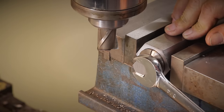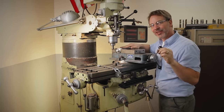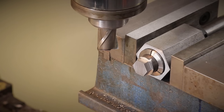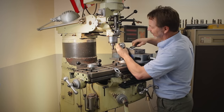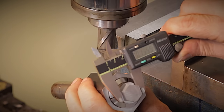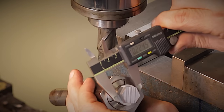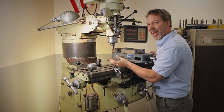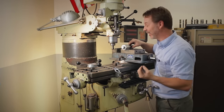That easy. Let's see how the wrench fits. Oh, that's pretty good. I also left some trolls on that — leave in the comments if you see what a troll is going to complain about on that last cut. Let's check how accurate this is: minus one, minus one, minus two, one. So we're plus or minus 1/1000 of an inch, which for a nut is really, really great.